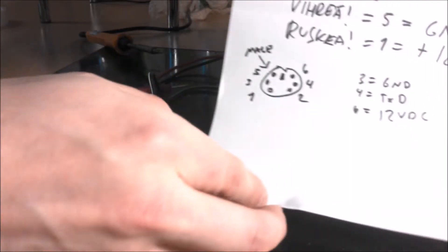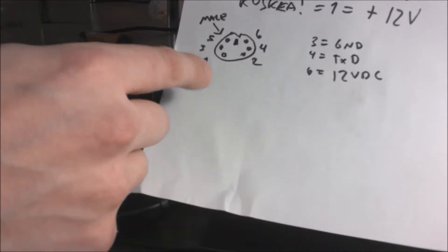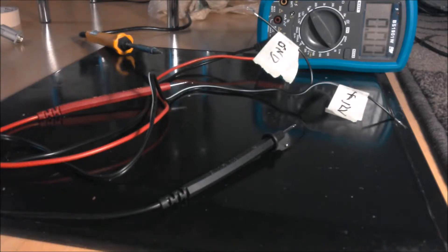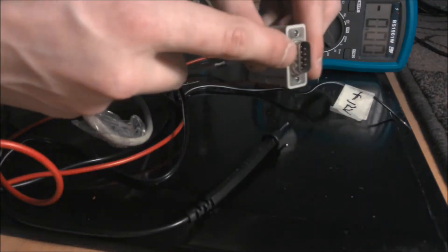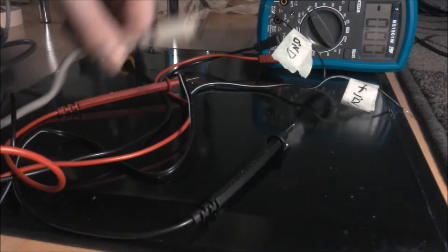Now that's done. Here's a picture of the normal connector going to the BA63 display — this is a male connector, and by knowing what pin goes where I can map them. You also need this kind of cable to get the job done. This is the part that normally goes to the POS system, and I have the RS-232 cable where both ends are female. So I'm going to attach this one to the POS cable going to the cashier screen and then measure from this cable.